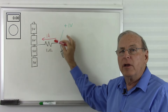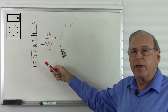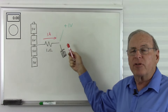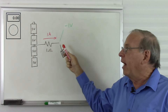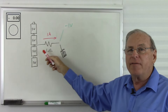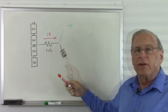So both of these voltages went down. As my current increases, my voltage measurements will all go down. Now if the current flows the opposite direction, this voltage must go down to minus 1 volt. So now my black probe is at a volt too low. When I measure this voltage, I should see positive 5, but with minus 1 here I'm going to see positive 6 volts. And at this point I should see negative 5 volts, but I've got negative 1 here — only a 4 volt difference — so I will see negative 4 volts. When current goes into this resistor, my voltages will all go up; when current comes out, my voltages will all go down. So this is not a suitable grounding point.